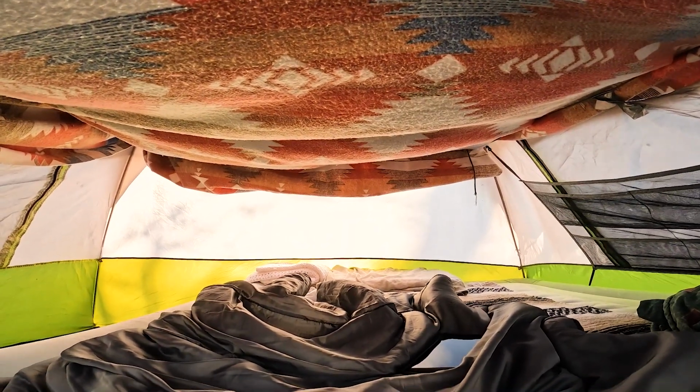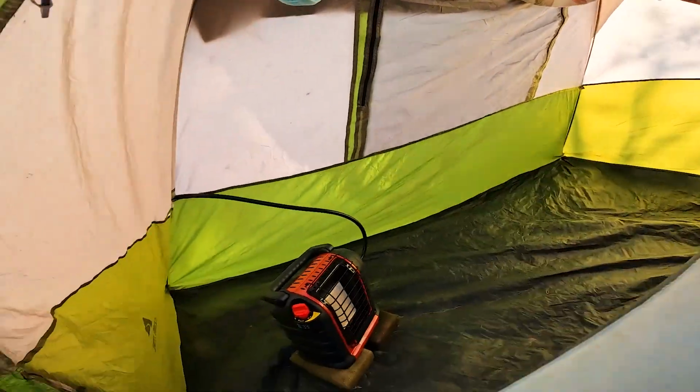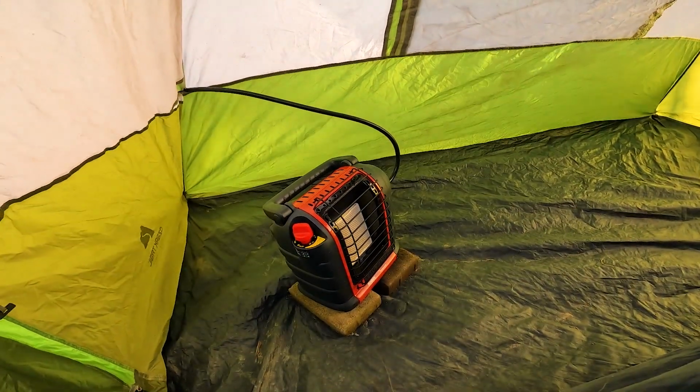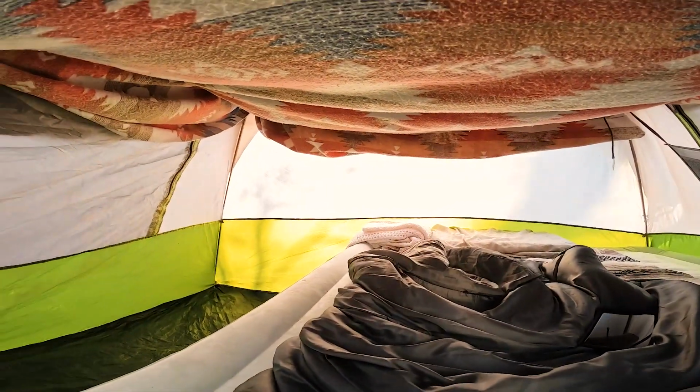One of the ways to reduce your energy bill, or reduce your energy consumption in this case, is to consider that when you're heating a space, what matters is where the heat's coming from, how much heat that burns, how much electricity it uses, and also how big is the space that you're trying to heat. So by chopping cubic footage out of the tent, I don't know how many cubic feet it is, but it's like a pyramid shape, probably at its tallest maybe 2.5 feet or so in the very middle, and then it gets more narrow on the sides. But it's a considerable amount of space that we won't now have to heat. Now, is some of the air going to travel up these little cracks and get in there anyway?